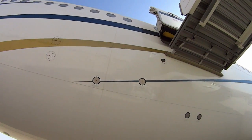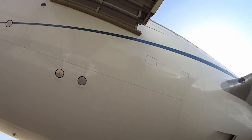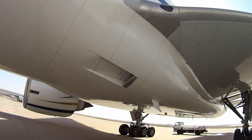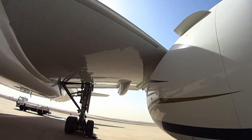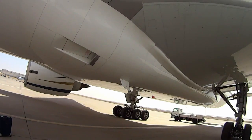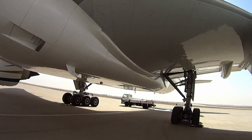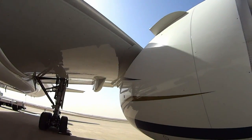If the static covers aren't open, you can have some serious problems. We check the negative pressure relief vents, ram air inlet for the packs — looking to see that nothing's dented, nothing's broken, everything's in the state that it should be. Then check the bottom of the airplane to see if there's any latches open.